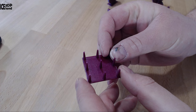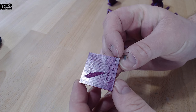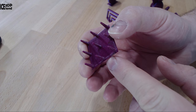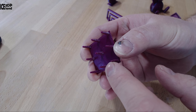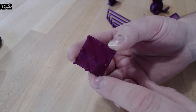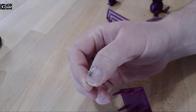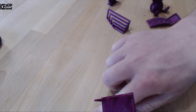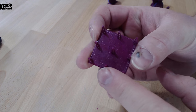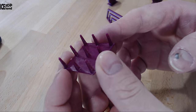This filament is violet in color and has some sparkles to it, like metallic flakes. It's a really nice color. I printed this retraction settings test and had pretty good results. I didn't have much stringing. There was some stringing at the topmost part and a little bit of other extrusions at the top with all the retractions, so the top part broke off a little bit.